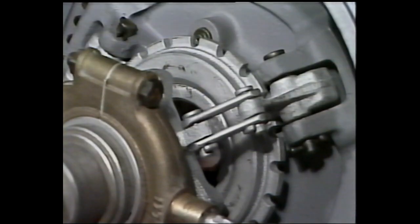On the MF760, also check the length of the rod holding the spring. Instructions for further adjustments of the rod are available in the MF Combine Setup Manual. The MF750 has a special nut at this location, and no adjustment is necessary. Once these two lengths are correct, the main drive belt will be properly tensioned.